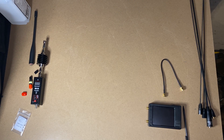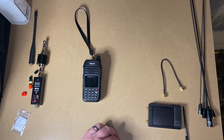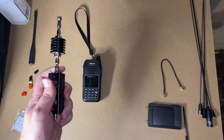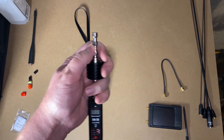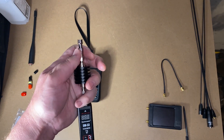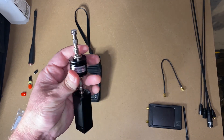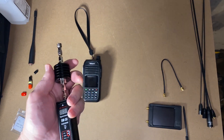Hello and welcome back to the channel, it's Matt with an overdue video. I apologize that this took so long to put together, but I did promise we would test the Talkpod A36 SE and we're going to find out if the SE stands for spurious emissions or not. Before I started recording, I put together my power meter and the dummy load it comes with — supposedly good for five watts. I didn't really trust that, so I put a 10-watt attenuator in between just to be sure I wouldn't fry this little thing.